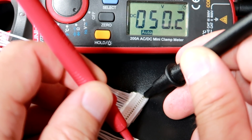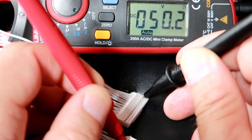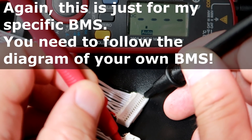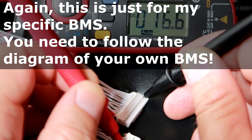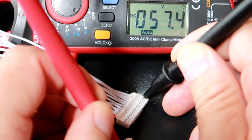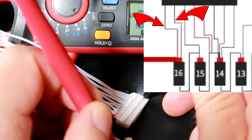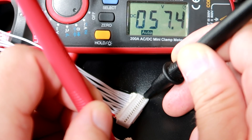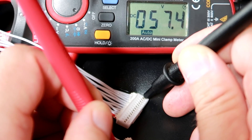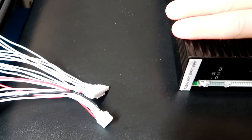This is exactly as shown in the wiring diagram — you need to connect those five cables to that one terminal for this 16S battery configuration. Continuing, we get 53 volts, then 57, and the final contact also reads 57 because two cables connect to the same most-positive terminal. Our total maximum battery voltage is 57.4 volts. Everything is perfect, so we can now connect the balance leads to the BMS.